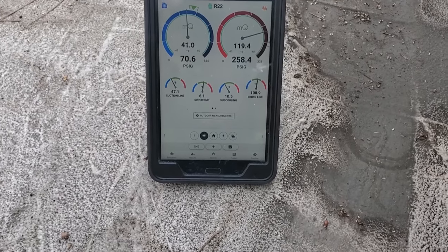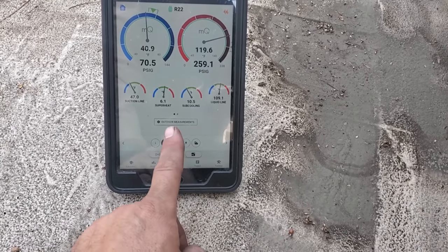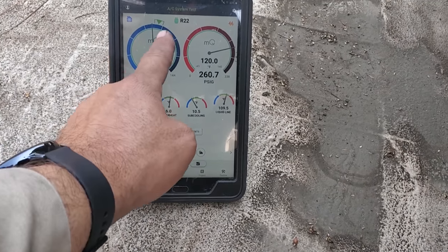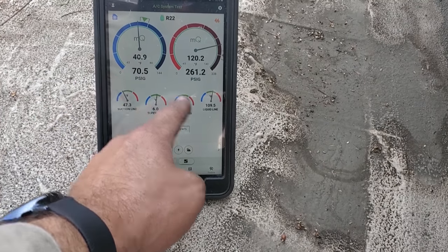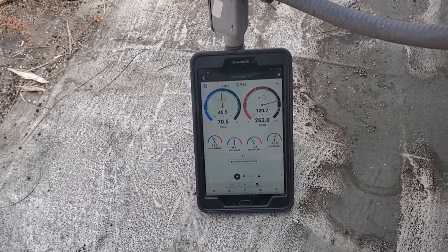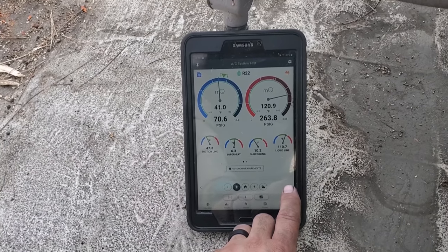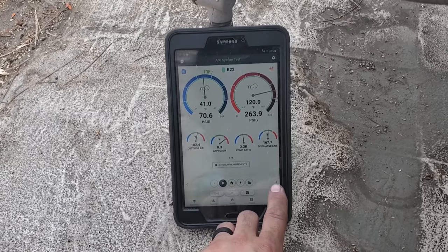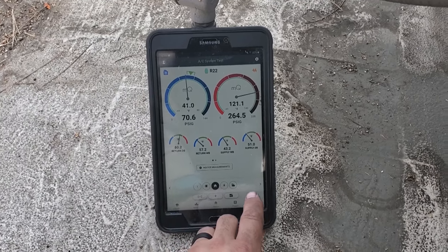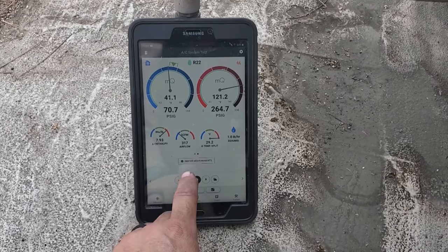The first stage is set up as a piston, 10 to 12 SEER, R22. Superheat's not too bad. Our targets are a little high, meaning our actual pressures are a little bit lower than what the targets are. As usual, this unit has airflow problems, and it's also pulling a bunch of outside air because the economizer is bad — it's just manually opened. You'll see it in the temperature split: there's almost a 30-degree temperature split.